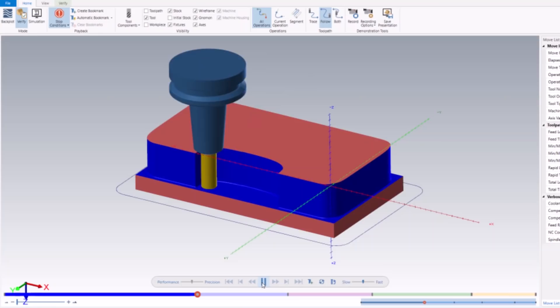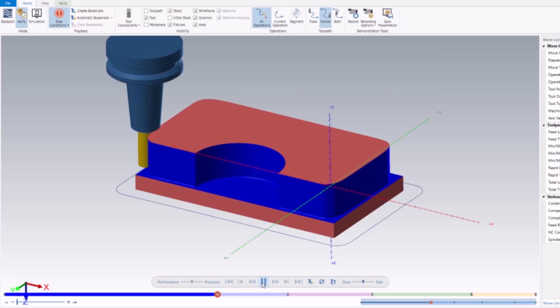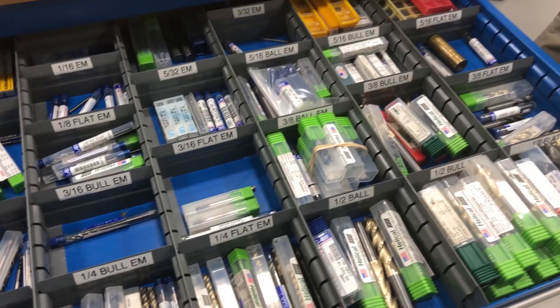We started using their five-flute for a particular application. It was a significant time saver, and then we realized that we were getting about 600 minutes out of the cutter — and we realized that we needed to utilize that more often. We started to hear that there was going to be a tool catalog for Mastercam, and Mastercam is one of our partners. So we started investigating that opportunity. Once that was implemented, we've been able to utilize all of their end mill selections with very little hassle, just plug it in, play, and know that we're within 95 percent of what we need.